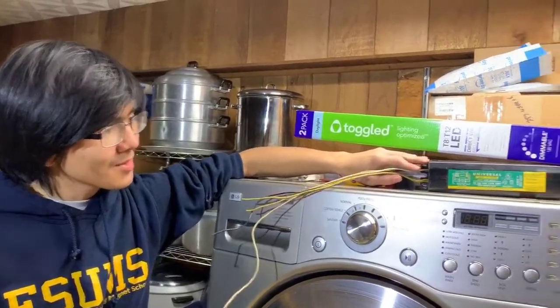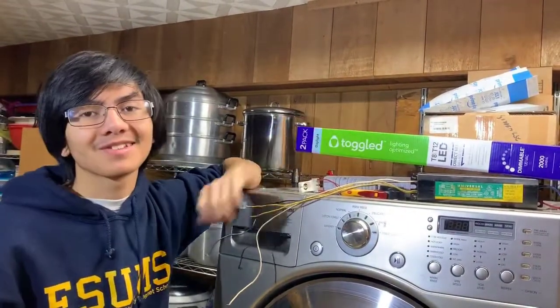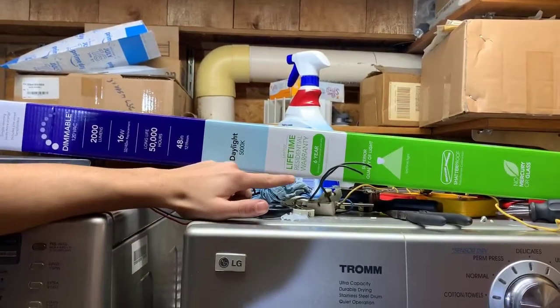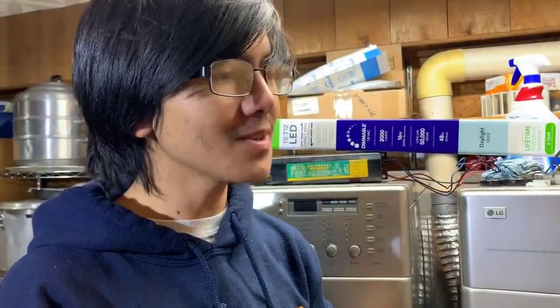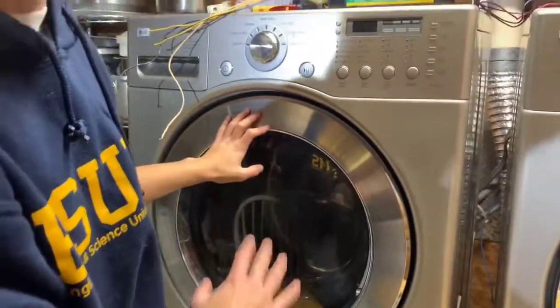So I'm Aiman, and today I showed you how to replace fluorescent lights that use a ballast with the Toggled T8/T12 LED direct wire that doesn't even need a ballast. This is by far cheaper — $20 versus the $40 ballast replacement option — so pretty worth it. There's also a lifetime residential warranty, so you might want to keep that in mind. Please like, comment, and subscribe, and check out our other videos — we just did a video on how to replace a light switch. The next video, we're probably going to be fixing this washing machine. I'll see you there — signing out, peace.